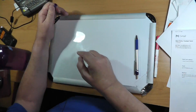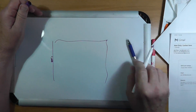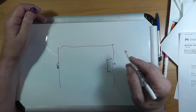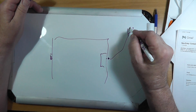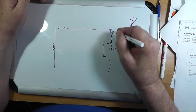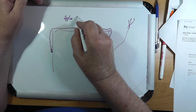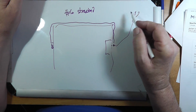Okay, there's a couple things going on here. Let's just look at the whiteboard for a minute. He is in a house. His utility ground is here with his meter right here, and he's over here with his shack. He's got a ground rod here where he puts his lightning arresters and things like that, and they run out to the various antennas. Now he wants to bond this ground and this ground, and he would have to run about 75 feet of number 6. I would recommend stranded, just because it takes RF better.